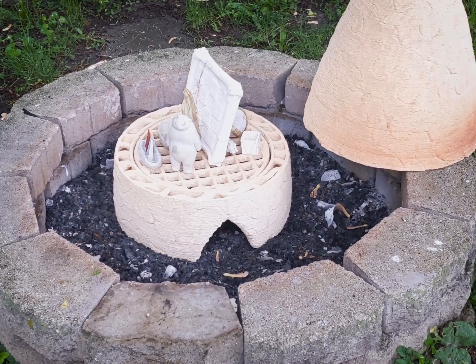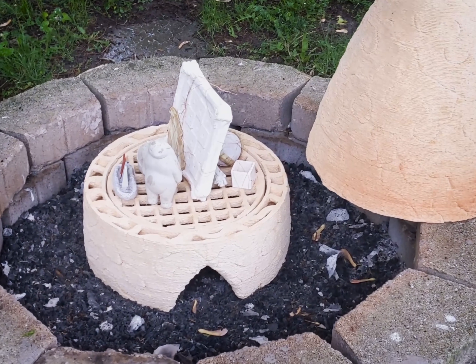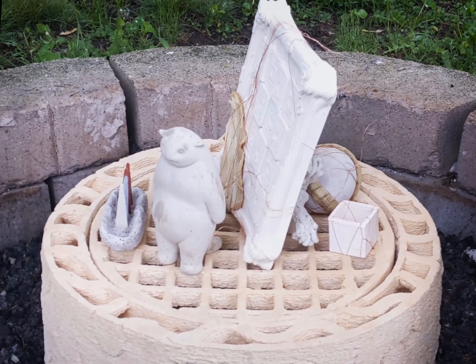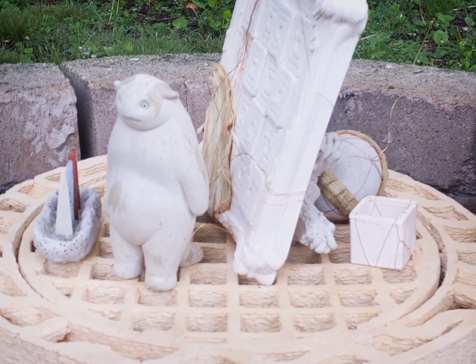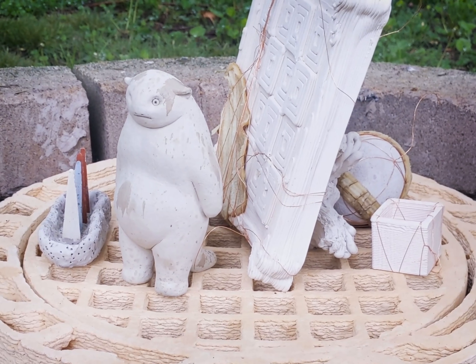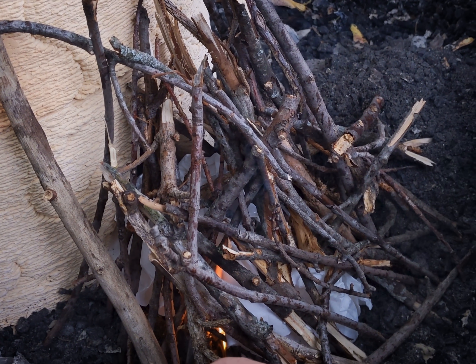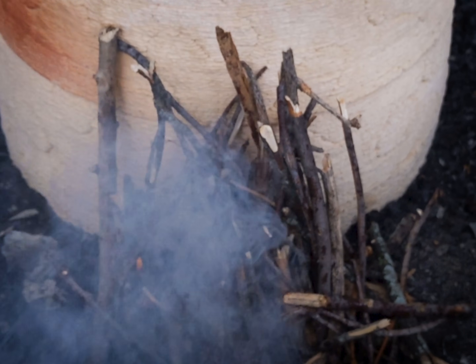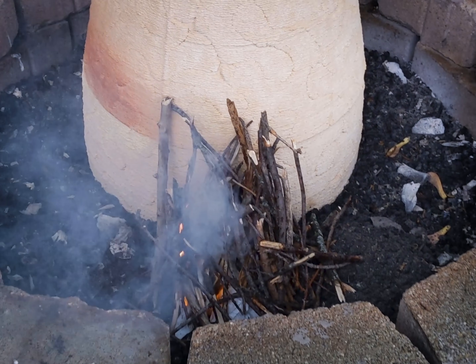As you can see, it's raining pretty hard — a perfect day to fire a kiln. Going in, we have a couple of green pieces, both paper and regular clay, thin and thick wall, and a couple of bisqued pieces bound with banana peels and copper wire to see if we can get some potassium or copper flashing. Also a cone pack. We're starting to fire outside of the kiln and slowly pushing the coals in to prevent the temperature from rising too fast — a mistake I made with the paper clay kiln I test-fired last week. Check out the video for more on that.